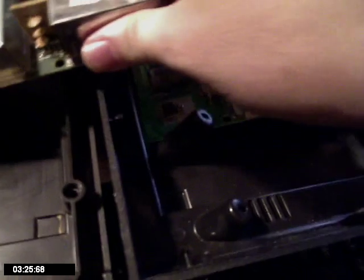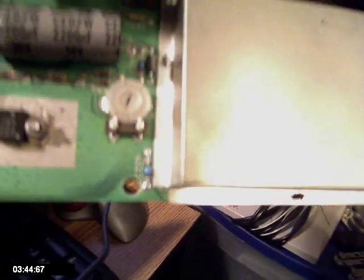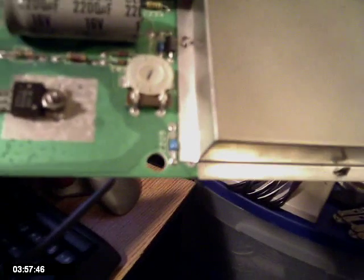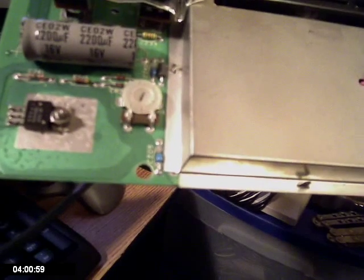So on the circuit boards here, some major differences, some subtle. Show you guys the old one first. That there is what I'm talking about on adjustment, and both of them have it. That is to where you do have to have a cartridge in, preferably Atlantis, like I say, so you can see the background, and have it going, and then make very, very subtle adjustments if you have it to where the color just looks a little bit blurred, maybe not a lot, just a tiny little bit, or just the color looks out of sync, wrong colors. You can adjust that and go through the cycle of colors.